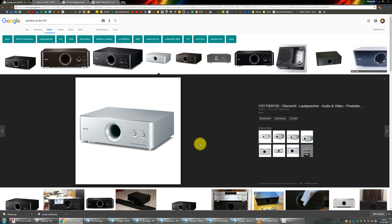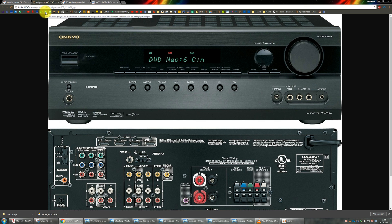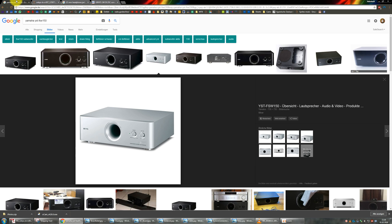I'm going to show you a little more technical detail about this connector, how it works, and how you can possibly hack it to work with other devices, since by default it only is supposed to work with other Yamaha devices. In this case I'm going to make it work together with an Onkyo receiver, the Onkyo TX-SR307. The reason I'm doing this is because when I tried to do this mod myself the first time, I couldn't find any information about this connector and its specifications online, so I had to guess. I want to give you guys the information I found out so that you can do a hack like this more easily.